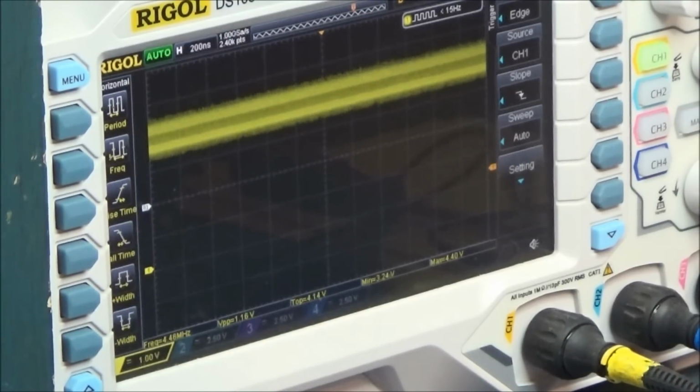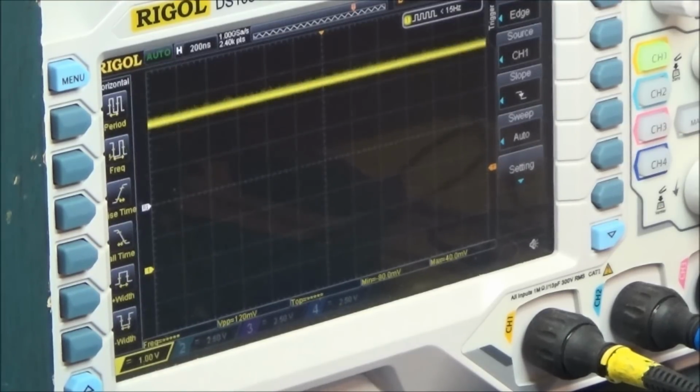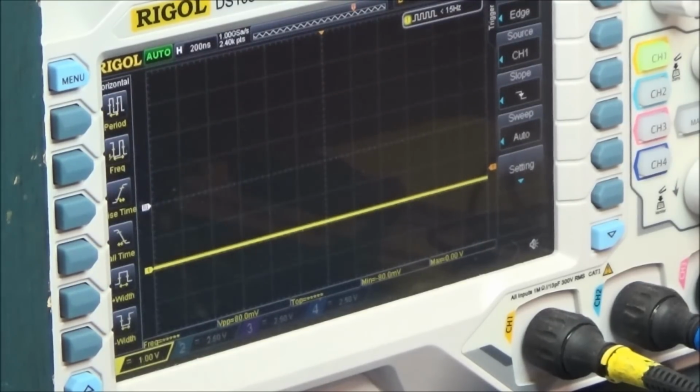So I'm kind of thinking that this chip, this 138, I mean that signal is directly from the Fluke right now, pin 4. That's not the socket. That's why I got no outputs. I got no enabling outputs out of this 138. So I honestly think at this point that 138's got to be stuck high. I think pin 4 is just pulled high and stuck high internally. So I'm going to stop, unhook this, and replace this 138. And then we'll see what we got. So I'm going to go ahead and switch this off. Stop the Fluke. Okay. And I'll come back.